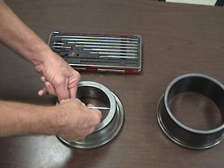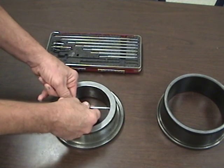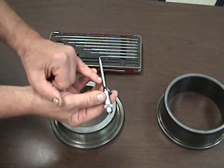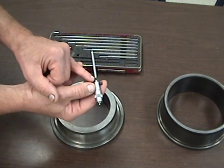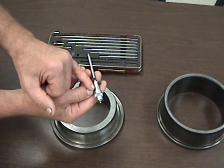Looks very, very good. We've got just a little bit of resistance — that looks good. So the way we read this: we see our rod is four to five inches, so we have four inches to start with, starting on the low side. We have a half-inch spacer that's 0.500, and our micrometer head reads 0.250.